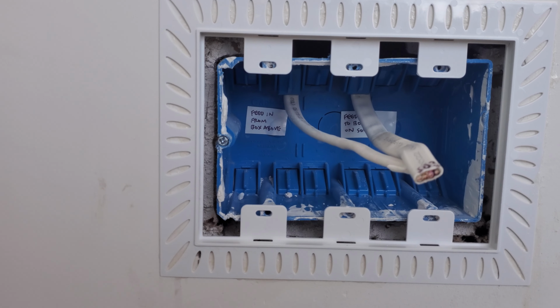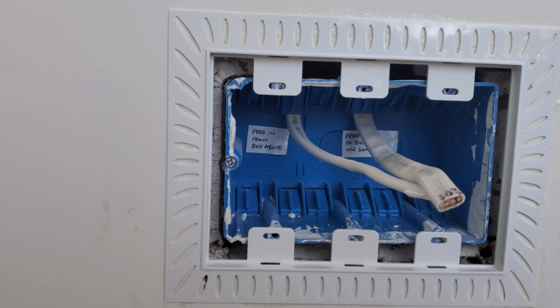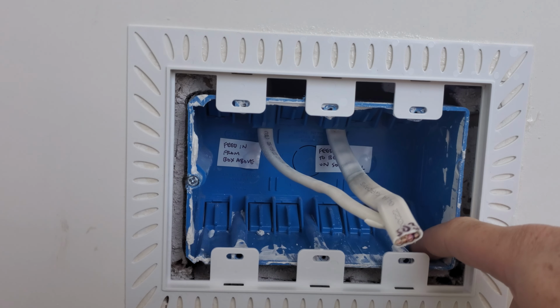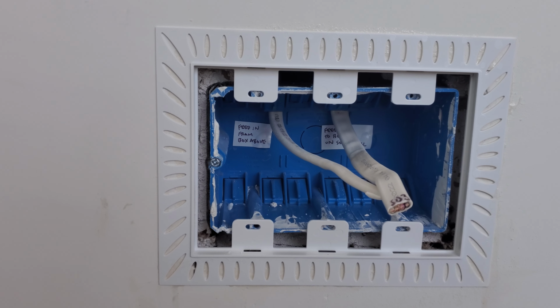So pros and cons, I guess, are that the nice thing is it's always a bit of a struggle with getting your outlets square because you're dependent on the rough-in box. Maybe it's hard to see on the video, but for example, this rough-in box is kind of wanting to squish up because of whatever reason. They always want to do something weird. We did get these adjustable ones for depth. So this one has this screw. If you screw it in and out, the depth of the box will change in and out. That's definitely something to use if you're going to use these plates.